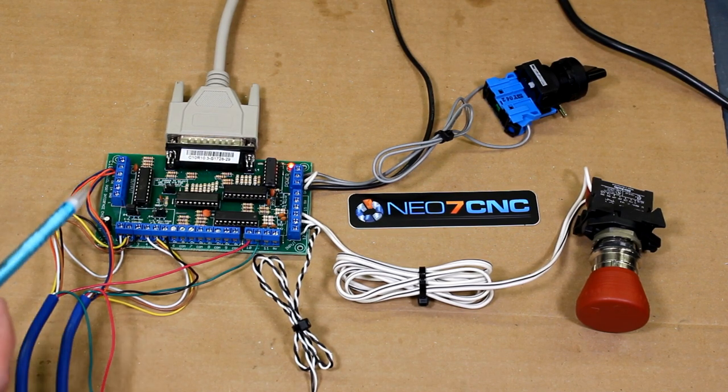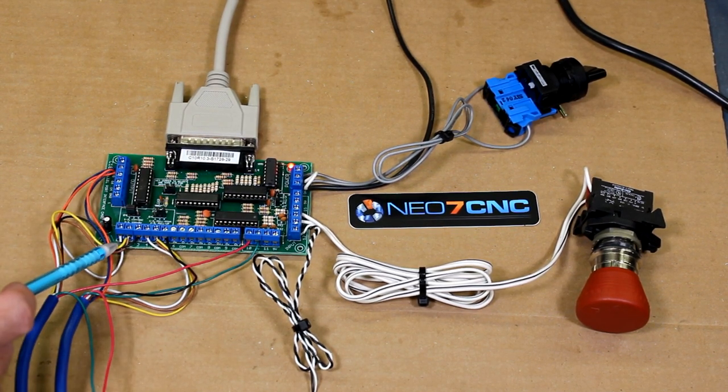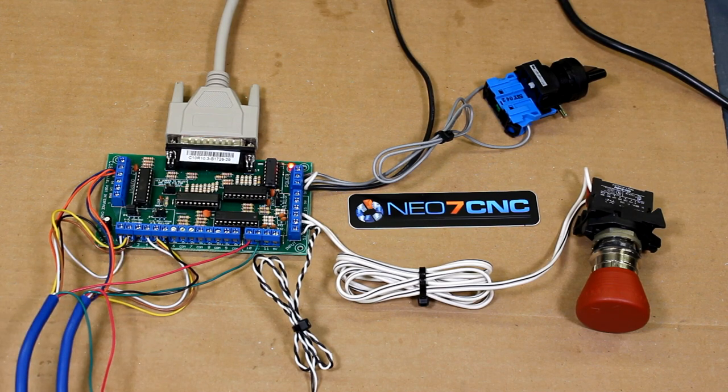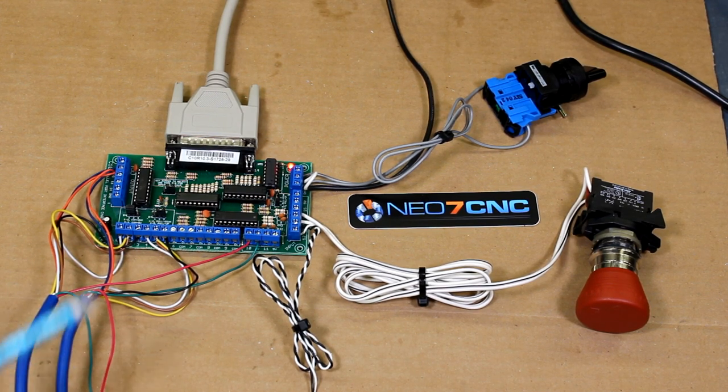The way Mach is configured, port 2 is direction and port 3 is step. The white wire is in port 2, yellow and brown are connected together into the common between ports 2 and 3, and the black is in port 3. This is exactly the same as if you were hooking the C10 board to a stepper motor driver — step and direction commands with a common between the C10 and the controller. The connecting of two wires together is a ClearPath-specific setup thing. The next three ports are the same setup for the Z-axis.